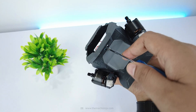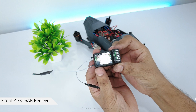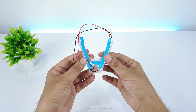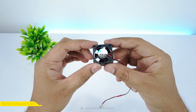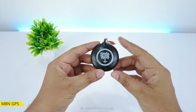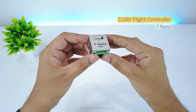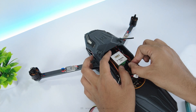The front latch is attached and the gimbal is fixed. Flysky's 6-channel receiver is mounted with dedicated antenna slots — simple, clean and efficient. The headlight is 3D printed using translucent PLA with an LED mounted inside. On the top plate, I've installed a 3010 cooling fan to prevent heat buildup inside the frame. The GPS is an M8N module that locks position fast and holds steady even in crosswind. At the core is the CUAV Nano 7 flight controller — compact, powerful and ideal for space-limited drones like this one.